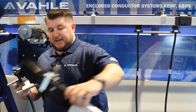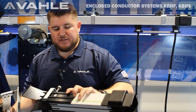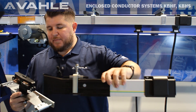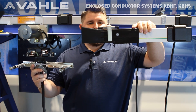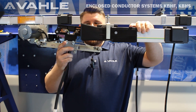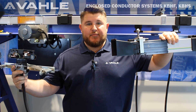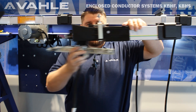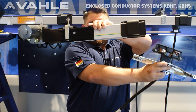What you're going to see is that this fin right here needs to go on the opposite side of the ground bar. So you have the ground marking and that needs to be on the opposite side. As it's coming through here with that slight decline in your conductor bar and your funnel, it's going to come in like this and it's going to catch it — coming towards it, and then boom. There wants to be a slight decline in that as it comes level through there, and then smoothly transitions through.